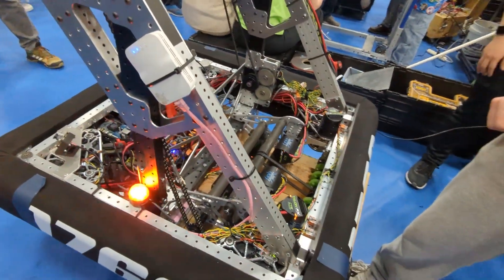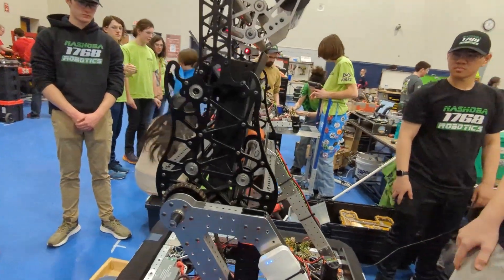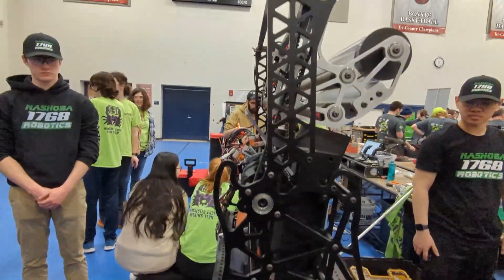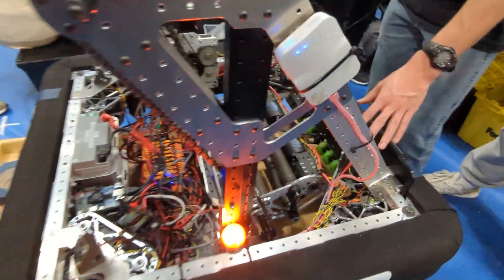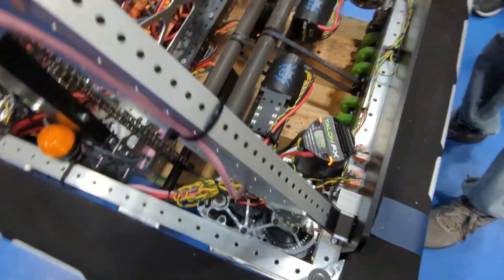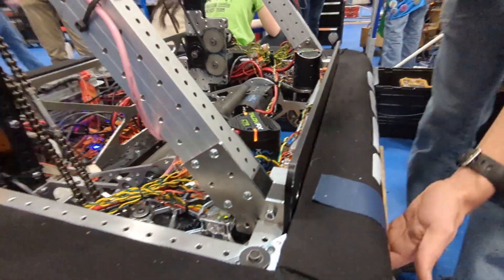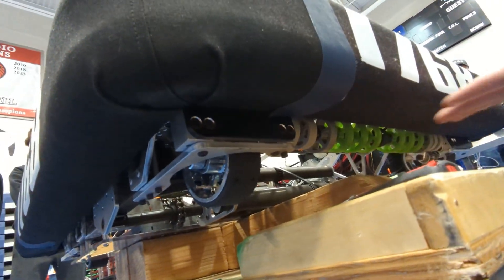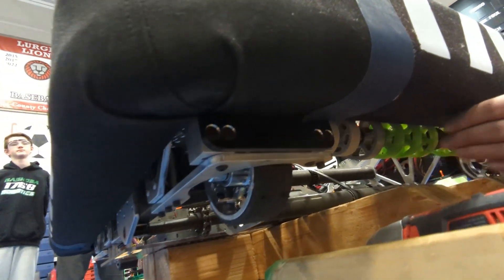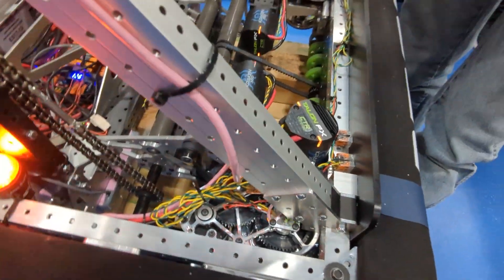We also have beautiful guitar plates, which is kind of our pride and joy, but making it work is obviously more important. Something we had to do this year — as you may notice out front here, we have a couple of our Krakens flipped, which is not stock for the Swerve modules. So we had to remanufacture a bottom plate for these so that we are able to intake the note without compressing it on the sides, which solves a lot of problems. We had to manufacture a new piece to modify the Swerve modules to accommodate for that.